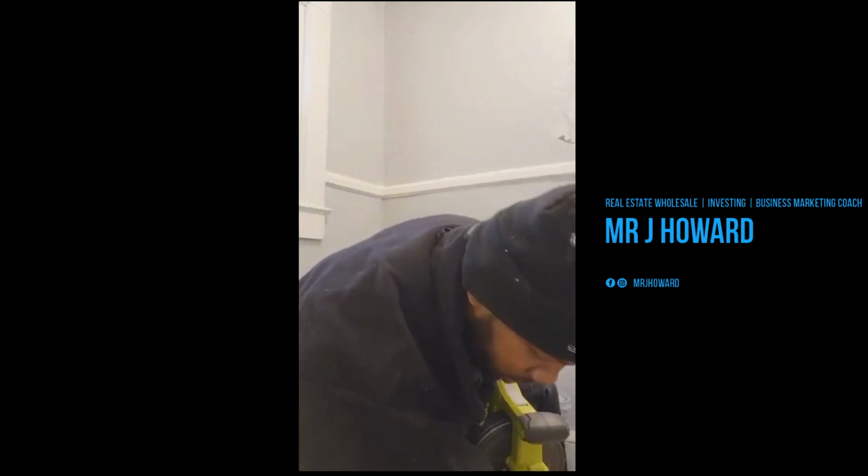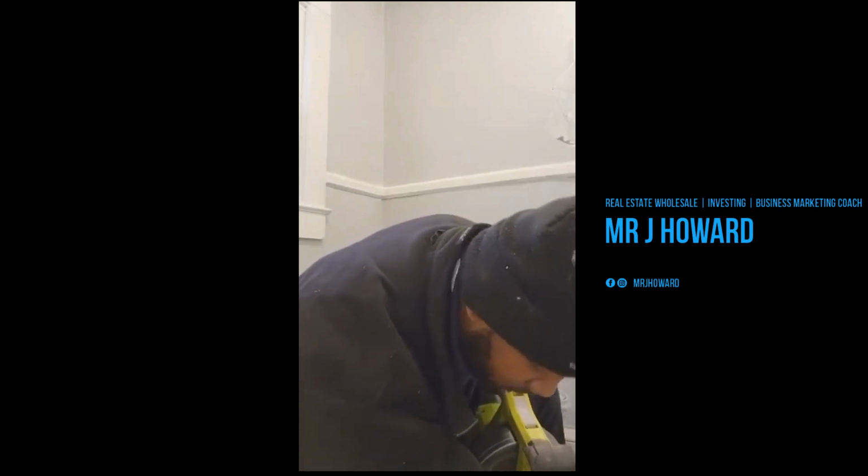And I'm just kind of moving the snake back and forth, watching it get whatever that is down that pipe. We're not that far from the main here, so you just want to keep pushing it. You want to be careful if your customer has already put like Drano and stuff like that in it, because you don't want that bouncing in your face and your mouth and your eyes.